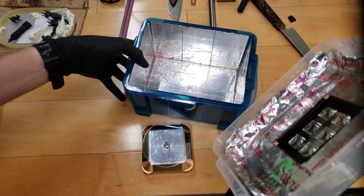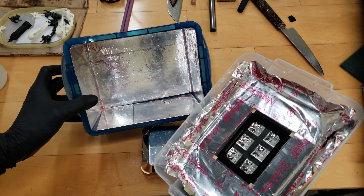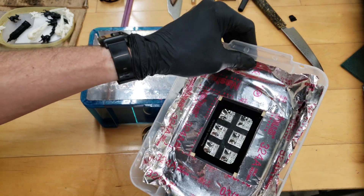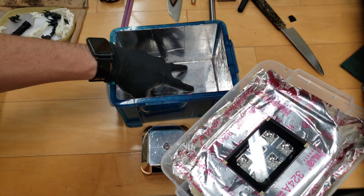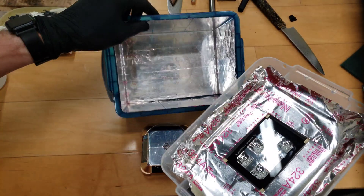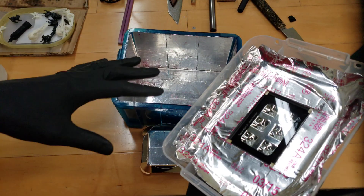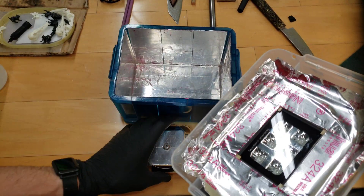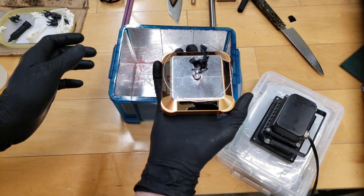On the inside of the plastic box I lined it with reflective aluminum tape — this is just your ductwork tape, it has a little bit of rigidity to it. I covered the whole inside of it and used some alcohol to wipe off the red markings, just to add a little bit of extra reflectiveness. What that does is bounce the UV around a lot so it tries to cover all the sides of the part when you're curing.